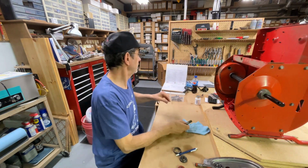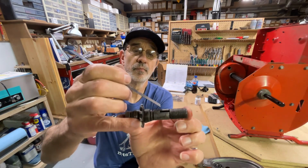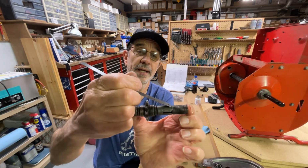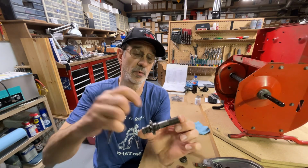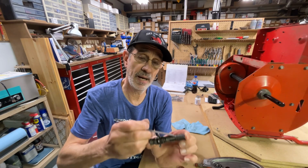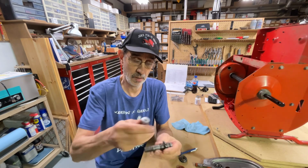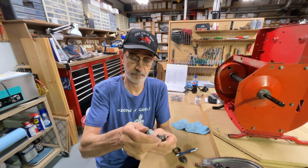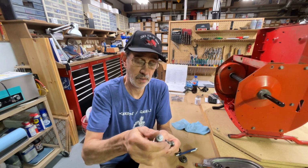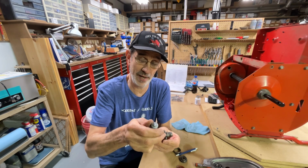I don't know if you can see that or not. There's a ridge sticking up right there. If I try to slide my scale down there, it hits right on that ridge sticking up. Looks like when their threader popped open, they popped it open a little bit too soon and left a ridge sticking up on that. Well, we got 629. There's no way.